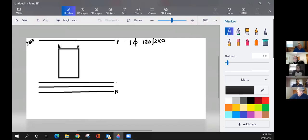And how you would connect that in the field is, of course, you saw us use switches or cutouts on cross arms to give transformers or a tap line voltage. So we'll go from a fuse, and I'm going to change this. We're going to connect the primary side, and I'm not going to show the windings in the transformer. Your primary side goes in, and just like we talked about, it goes through the windings in the transformer, and then it connects down to your neutral.